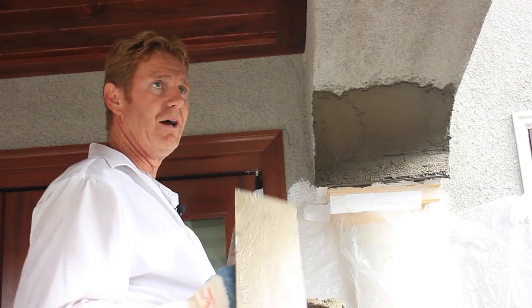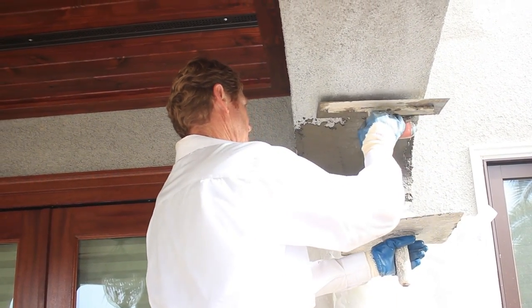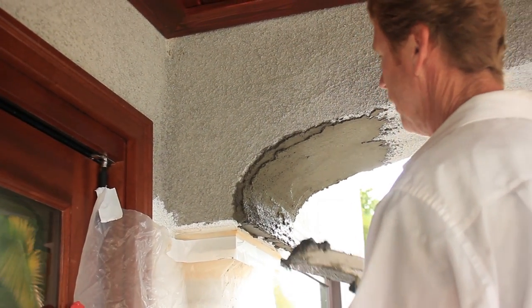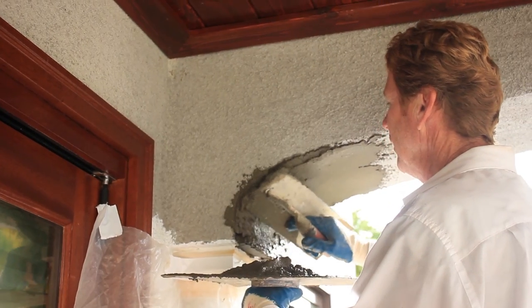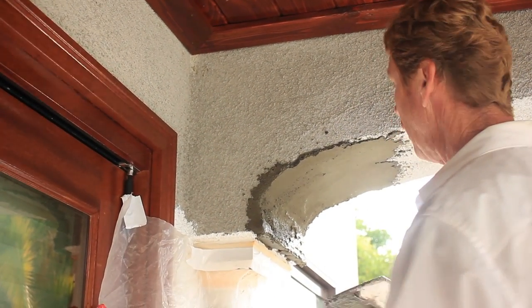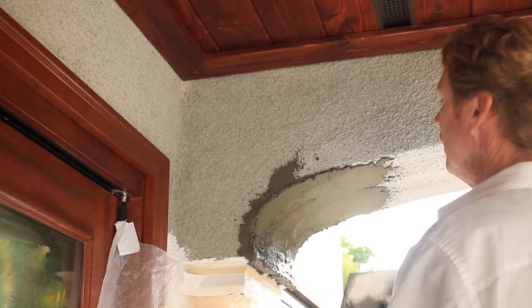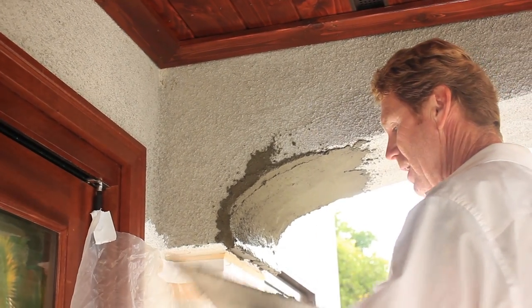Here's the second coat and yes I do have luminite in this too. The second coat — I just want to feather in. The further I take it here the better, as far as hiding that little flaw. So I'll take it right about there. When we're done with it I have to build this corner up too, which takes practice. You just go right here and catch it before it drops, keep doing that a little bit and then pull up that way to build this corner up. I actually while I was waiting for this to set did the other side too — we are always doing a couple of things at once. I just keep building this piece right here, take that and pull it upward. Now I'm going to do the other side — when I'm done I'll show you what it looks like.